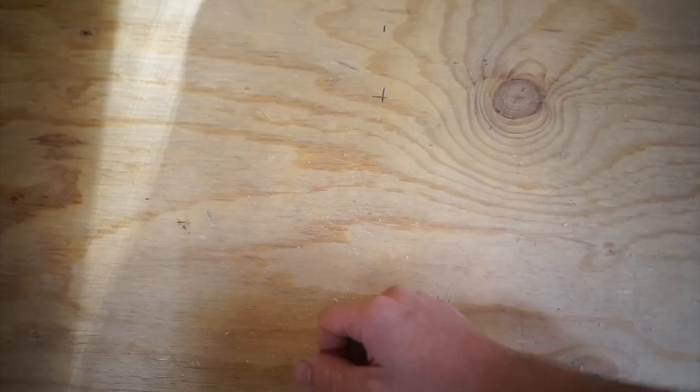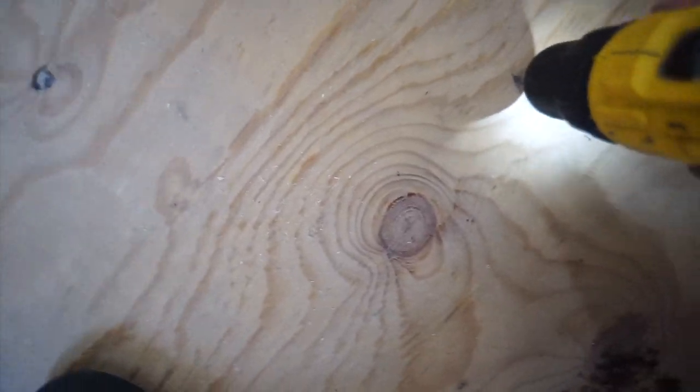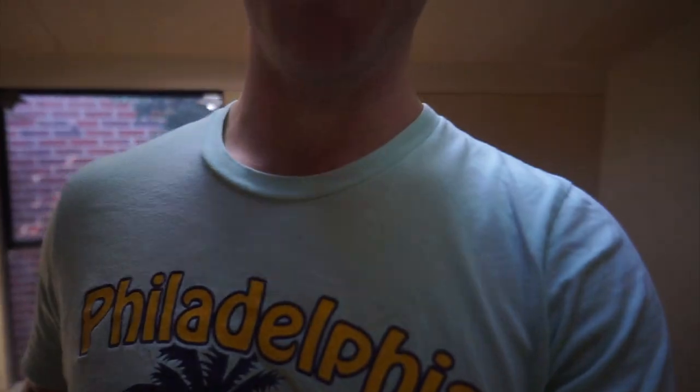I've done some layout here — this is the center of my drain. The last thing I'm going to do before I build this wall and commit to this shower pan is drill through there and see what's there, to see if it's feasible to make a drain right there. I have very very bad news — that's dead center on a metal support. I can't drill through that and I'm definitely not cutting it out. My prefab 30 by 30 shower base doesn't work in this location. I'm going to make this shower whatever dimensions I please — either a custom shower pan or a metal fabricator will make one. I want a 31 by 31 shower enclosure.